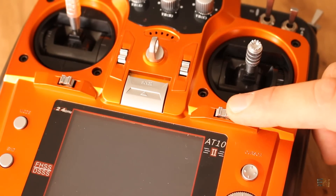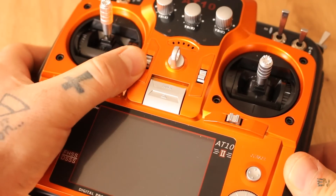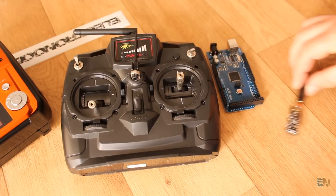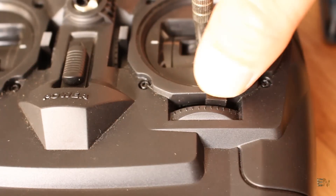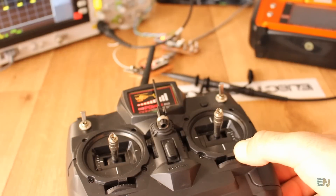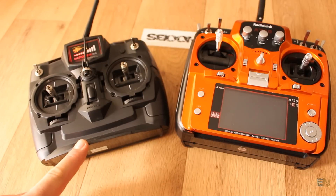On the front part we also have the adjustment buttons, which are 2 simple push buttons for each axis. The adjustment of the joysticks is made digital, as for almost all high quality radio controllers. For example, I have this older controller that I've hacked in a previous video — it works with an Arduino and the NRF24 radio module. The adjustment system for that one is made of mechanical sliders, so if you touch even a little bit the adjustment slider, everything is lost, and without a screen you can't find the middle position. That leads us to the next part of our controller.